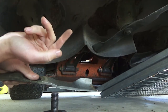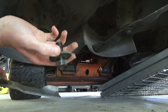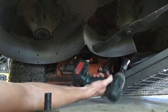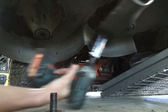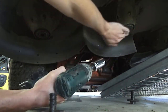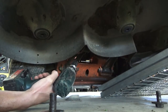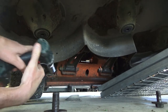So I'll take these two out, go get two, put them on, and then I'll just do the one on the other side there, okay? And I just keep the same bolt on the same side. I don't alternate the bolts, just a little habit that I do. Again, you don't have to do everything I'm doing. It's just to let you guys know. Okay, and then usually I just give that a quick clean around there for when the new one goes on. Happy days. Get rid of any bits of grass. Usually there's some string or something that you've picked up in the lawns. And that's it. I'll go get the other blades and throw them on.